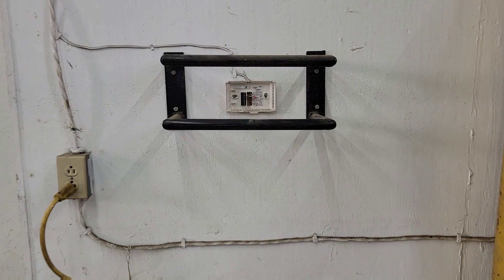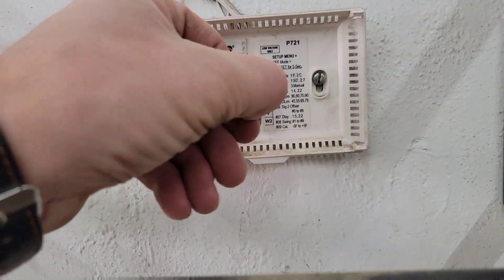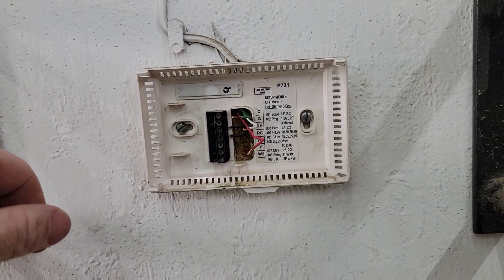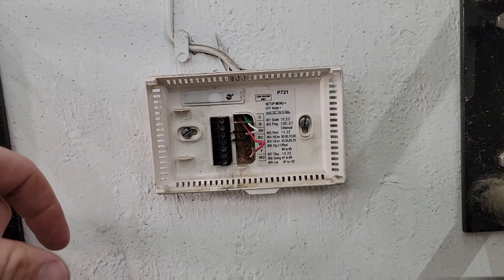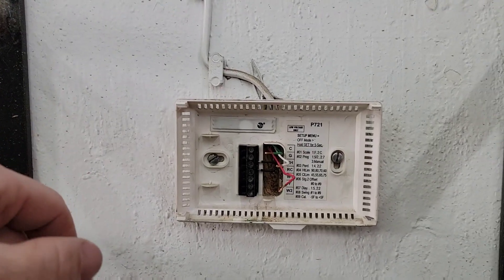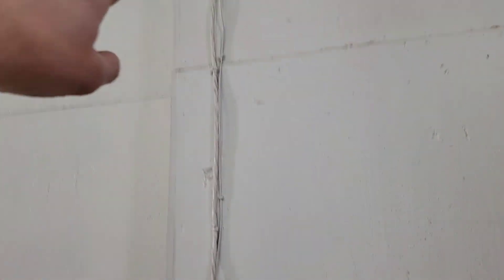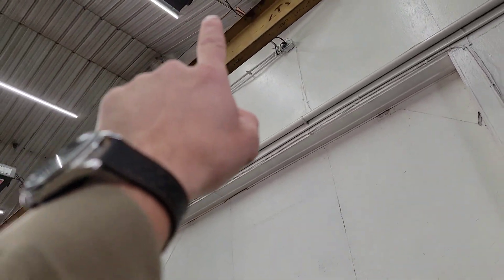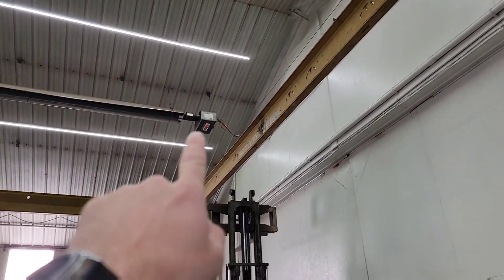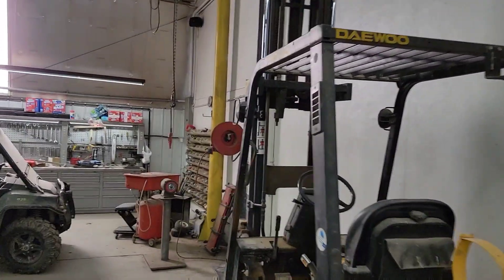So we're going to try that. I'm taking the old one off here — I took these wires loose. There's only three wires: it's a common low voltage and then a high and low fire, as it's a dual stage heater. So it's pretty simple, pretty straightforward. We should be able to do this. I'm going to take that off of there and then pull some clips, and I think I can just run it from this heater over to the other one, tie into the wires there, and then they come down to the thermostat.